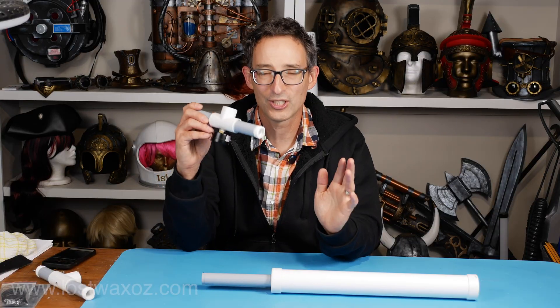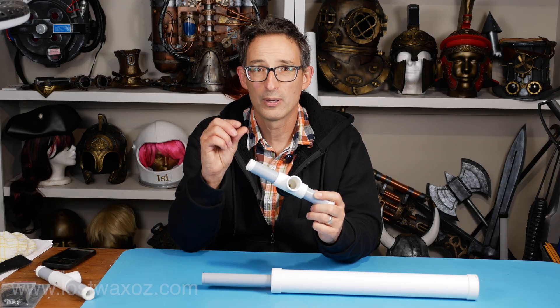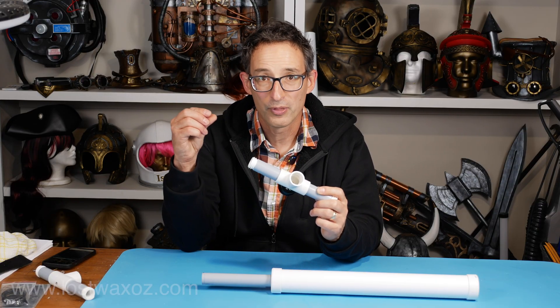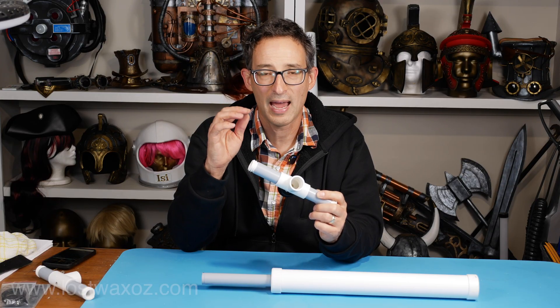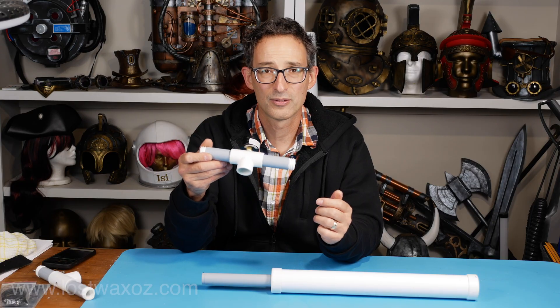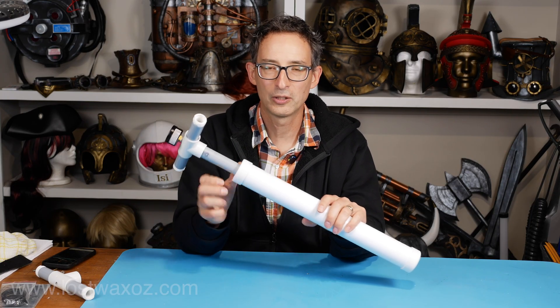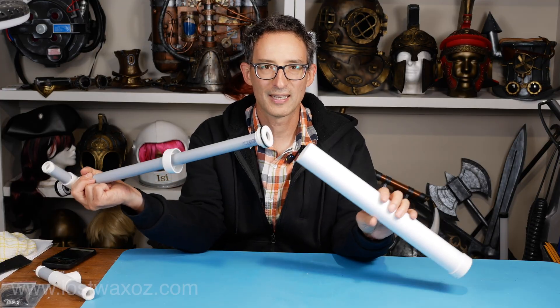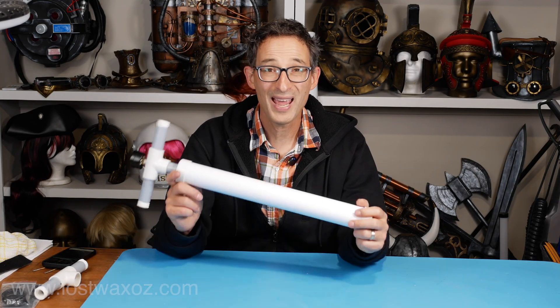Handily, I actually made two handles during this tutorial, so I had another one ready to go. What I would change is the construction of that part — instead of flaring the end with a soldering iron, I would 3D print a little cap that glues onto that rod, so there's no variability in how well you've flared the end, and that should help it not break. I intentionally didn't glue the end cap on, so it can come off and give you access if you need to re-grease the pump or fix something.